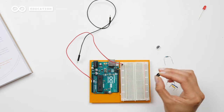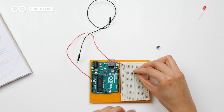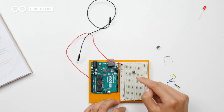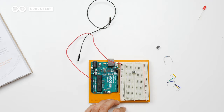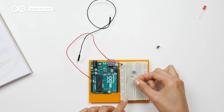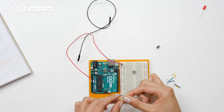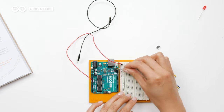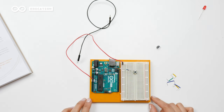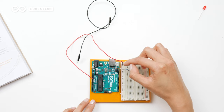Then I need the switch. Just make sure that you place the switch correctly according to which leg is connected with which — then it doesn't really matter where on the breadboard you place it. Now I need to connect the switch together with the 5V pin row, so I'll use the resistor to do that. I use the resistor because I don't want the LED to get too much power — too much power to the LED can damage it. So I put one leg here and the other leg inside the power line.